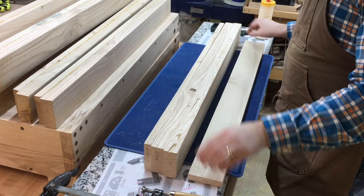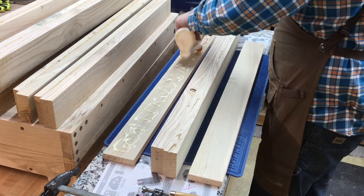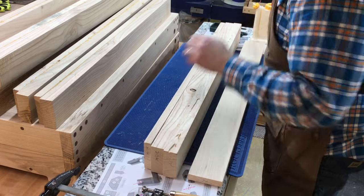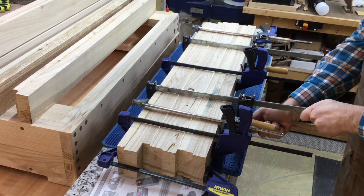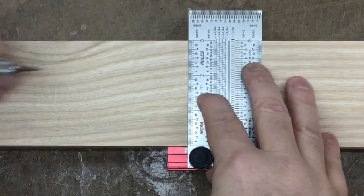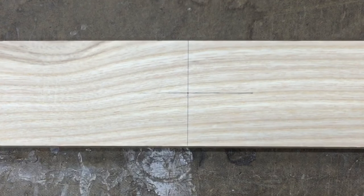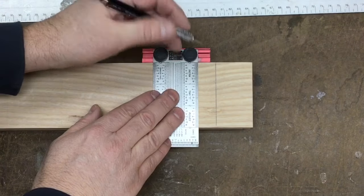For the F6 scissor arms, my ash slabs were not thick enough, so each arm is made from two pieces of ash glued together. Accuracy on the scissor arm holes is critical. First, I find the exact center of a single F6 arm. I also mark out the location for one of the end holes, but not the other. This is important to locate only one end hole.